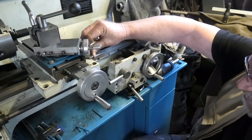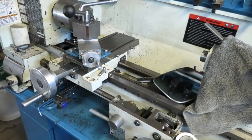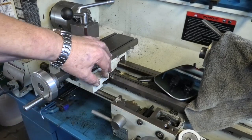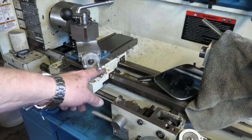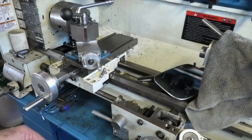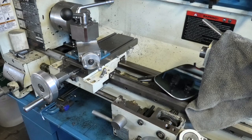The plate is back in place and the handle is back on. That's the lock position, which is great — exactly where it should be. Very simple in the end: just take the handle off, screw the bolt out, change the thickness of the washers, and put it back together again. You don't have to take all this apart if you know what you're doing.